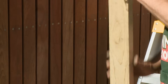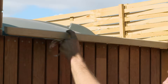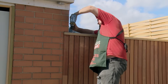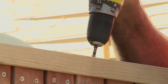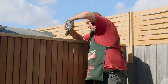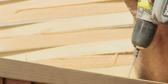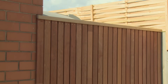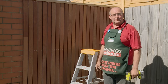Now that we've finished our screen, the capping on top will be the finishing touch. For that I'll be using my drill driver and some 50mm timber screws, screwing two screws approximately every 400–500mm. The screws are going into the top railing, which is the reason we took the top railing right to the top of the picket. The reason I splay the two screws is to stop the capping from warping over time. So this is how you build a timber picket screen — the capping gives it a really nice finish, and job done.